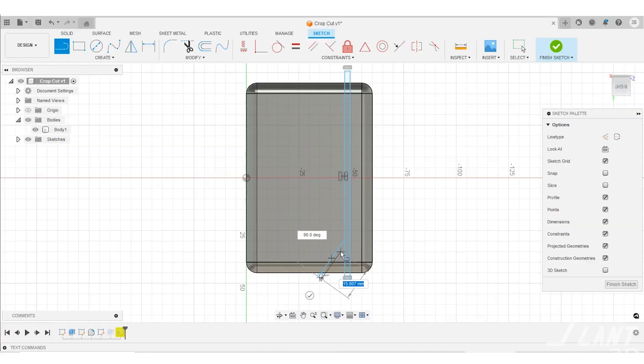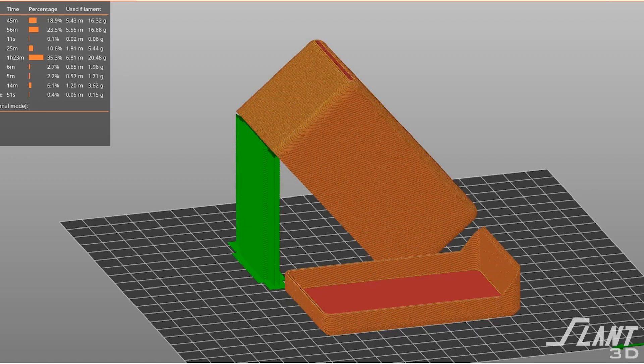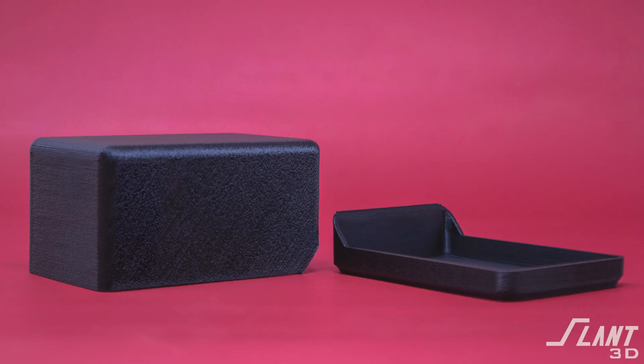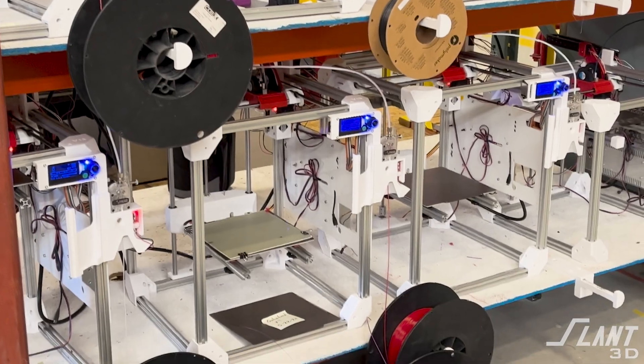This is a simple way to cut a dog-leg through the part so you can pull off the lid, keep it flat, and take the angled upper component and print it facing down so the outer surface finish is totally uniform — no variation between what's against the bed, vertical, or the top and sides. All sides look exactly the same, creating a nice-looking final part that mates with the upper lid. Printing the lid vertically is ideal because it's easy to knock parts off and allows you to print larger parts by standing them on end, taking advantage of the greater vertical build distance on production machines.